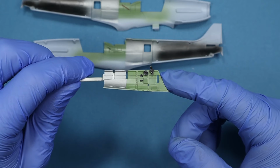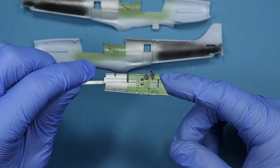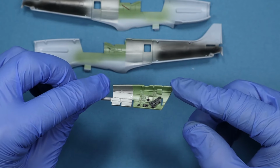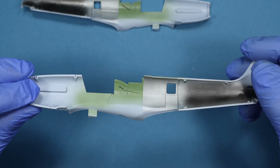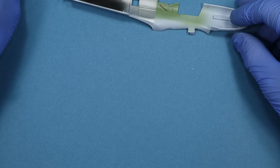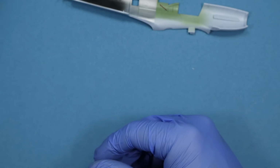This is the result after 2 coats, leaving 10 minutes between each layer and then overnight to fully cure. X22 dries quicker than most varnishes, and a blast from a hairdryer will help it cure even faster, but I would say it's best to leave it at least an hour before applying anything on top of it. And of course you can experiment with this and figure out what works for you.